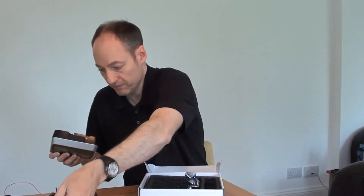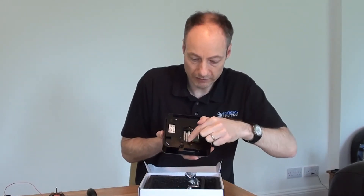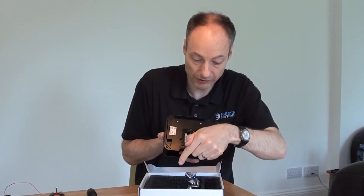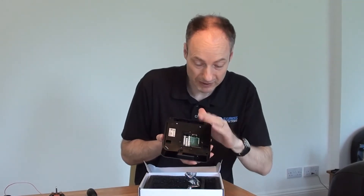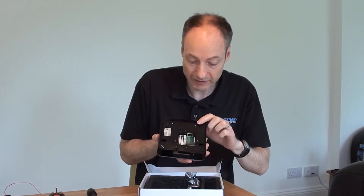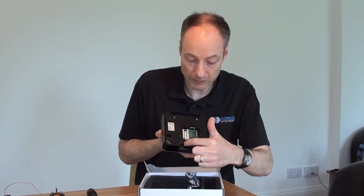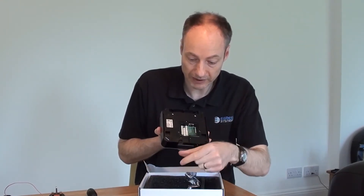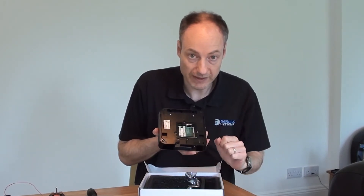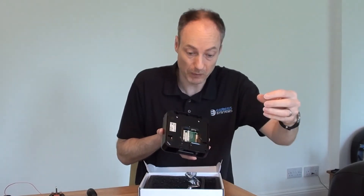So that's the backplate. At the back of the Biostation 2, there is a slot which we can use for threading our cables through. There's not a lot of space in the back, but there is a little bit. If you're only fitting a few connectors, you can normally squeeze everything in the back of there. Otherwise, you're going to have to bring your cables out and make your connections in some cable housing underneath, or perhaps bring your cables straight in from the back of the device, which in some ways is ideal.